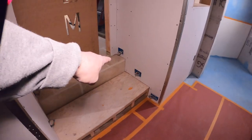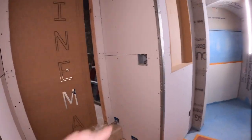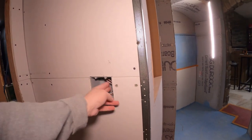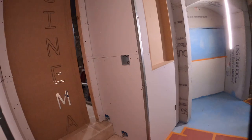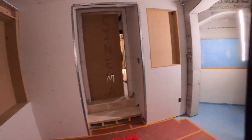We have three step lights on this side as well — all wired 18-6, all random parallel. This double-gang outlet: one will be a keypad for walking into the theater room, and one will be the keypad for lighting control on the lobby side. It'll also act as a three-way since there's already another Lutron in the entryway going into the bar.